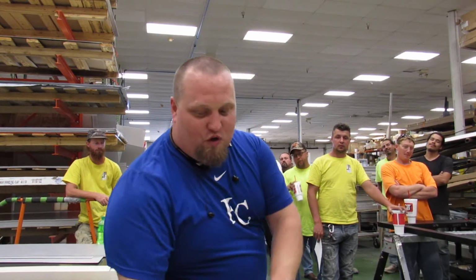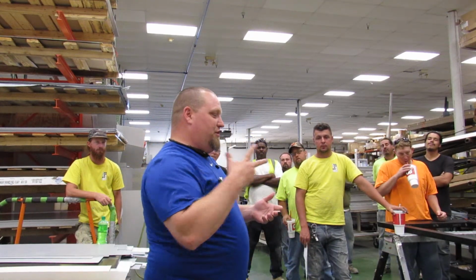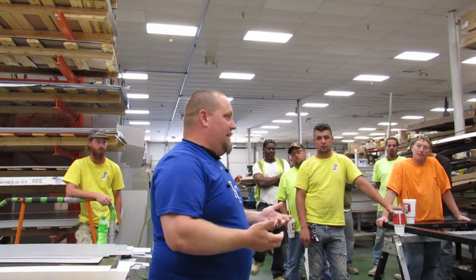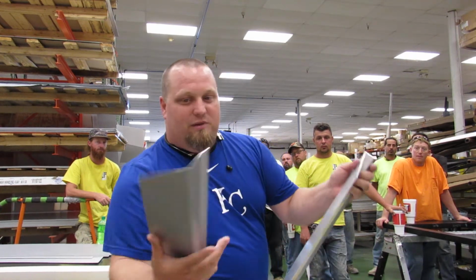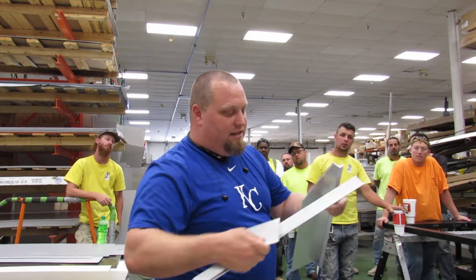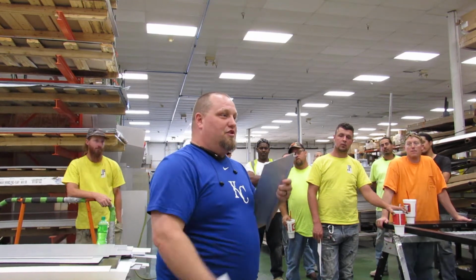The corners, I've seen most of the time, sometimes people are cutting your corner and just bending them together. And personally, I think it looks bad. I don't think we should be doing it. You get an automatic splice joint when you do that. The way that we should be doing it is mitering them at a 45, and you can use a square piece. The face is generally not a huge issue on your splice.